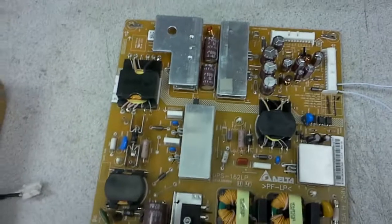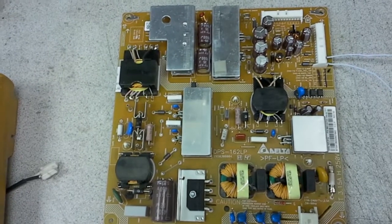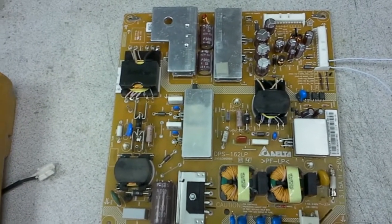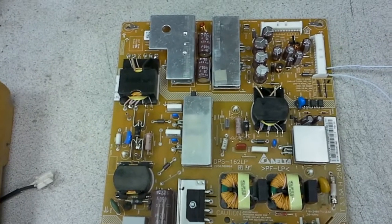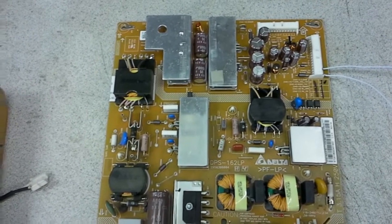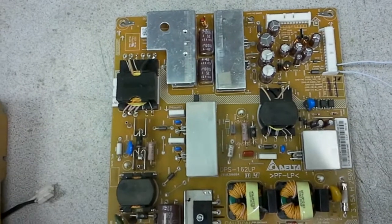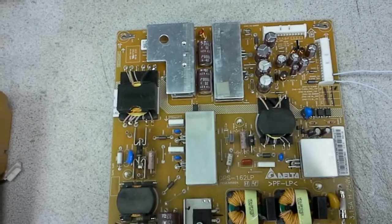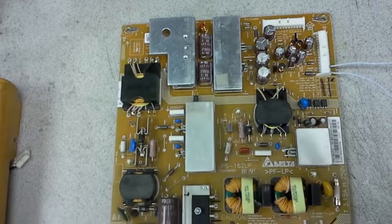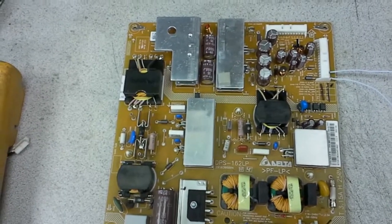Truth be told, problems with a power supply failing under load are maybe one in a hundred — roughly speaking, maybe even less. We don't have exact statistics, but they are rare, definitely. And it is simply not worth it, price-wise, to do a complete and proper test every time. People may say what kind of engineers are you if you don't test it properly — well, we are engineers that actually have to turn it profitable at the end of the day. With one in a hundred problems, unless there is a particular board known to develop such an issue, it's simply not worth it. We do test that known board under load.